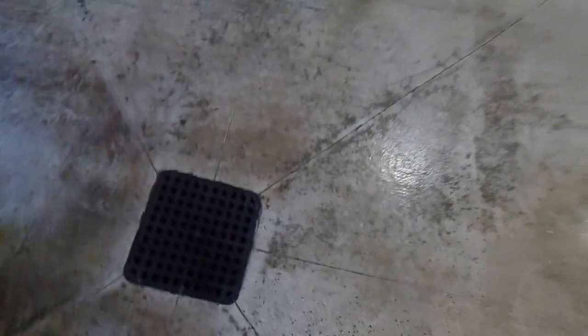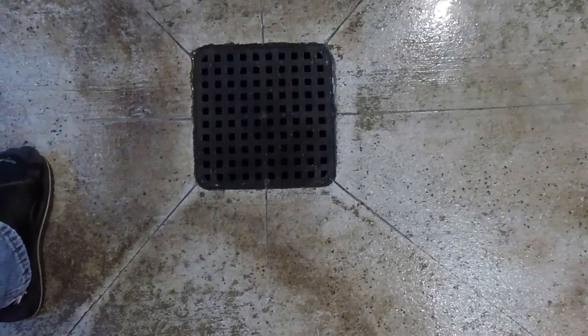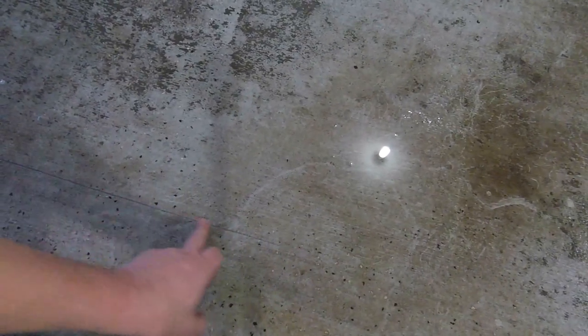Okay, here's the result so far. I carved a groove and extended it on all four corners, and carved a groove here. I sprayed water and didn't squeegee after, and all three of those areas are dry. However, I still have an issue here, so I extended this groove and I think I might make it a little bit deeper to attract the water towards the drain. Let's do it again.